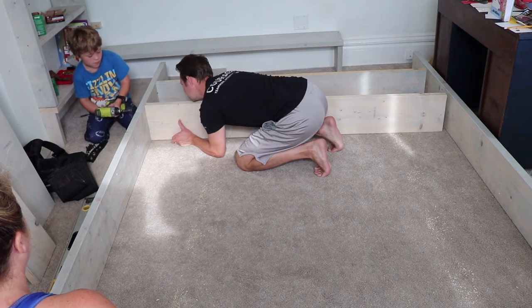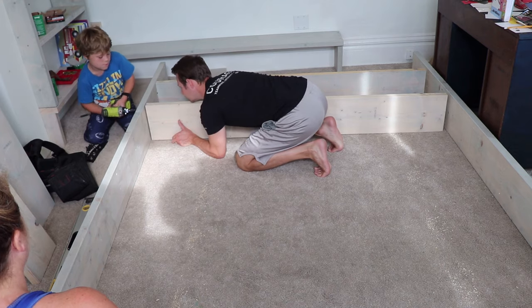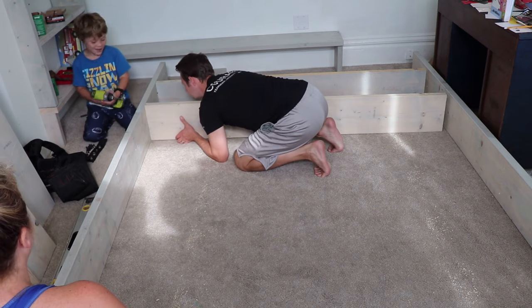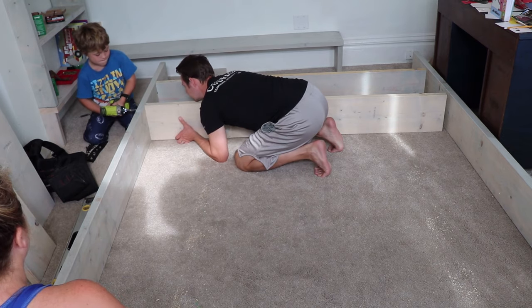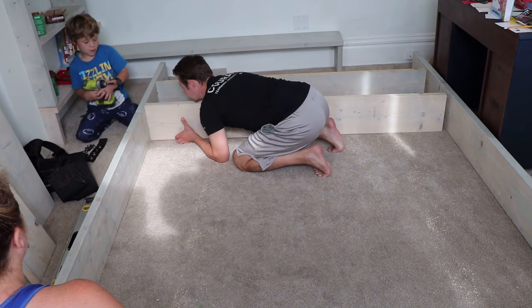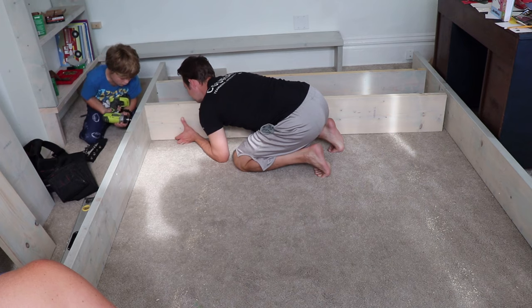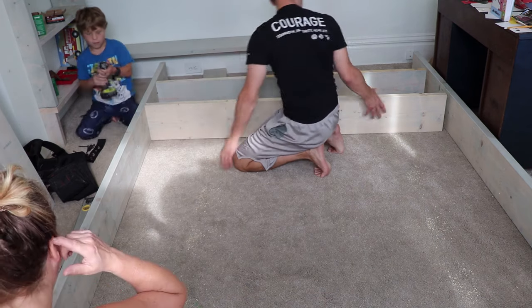So the first shelf that we did is a 2 feet span, leaving 10 inches from the wall. And then when you look directly at the wall, that's a 6-foot span, of which we divided by 3 feet with a support in the middle, just so that we didn't have any bowing, because that was really something specific that we did not want to happen.